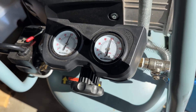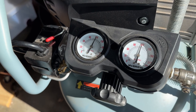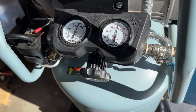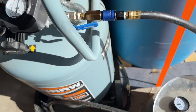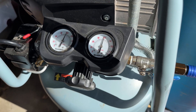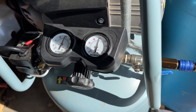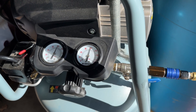You've got to understand too that when meters are reading this, they read air from two different directions — they read it forward and back, and that's how they can come up with the working pressure. Well, the gauge at the end is going to show where the most volume is being used because it's leaving and there's nothing really coming back — it's all going straight to the gun. Where the one on your tank, the regulator, is also showing some back pressure. And that's why that one can still show about 90 like we were setting it for. But this one was showing 80 on the impact wrench — and that's where people are really making their mistake. You need to crank it up so that this can get to 90.